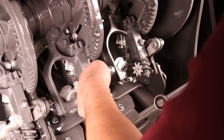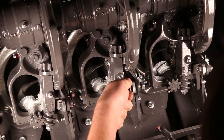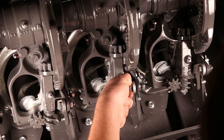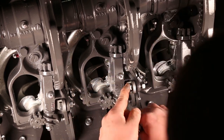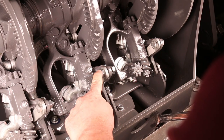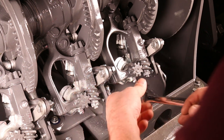We have that all the way loose now, and you can see it's a three-piece spring. Make a note: you tighten this up all the way finger-tight, as hard as you can. Then we want to tighten it an additional eight flats — a flat being one side of the bolt, so about a sixth of a turn.